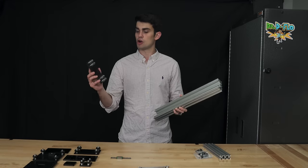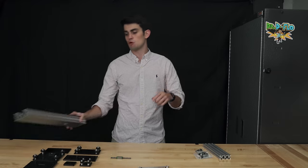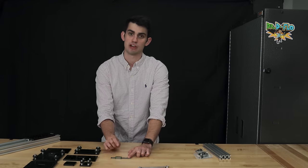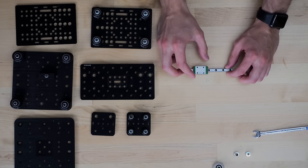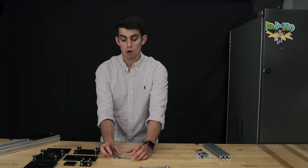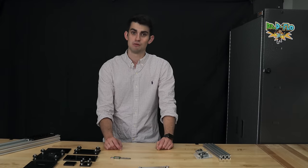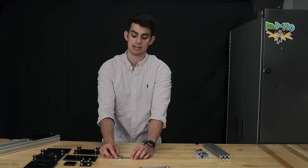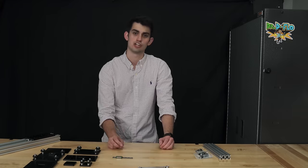We need a carriage or cart to ride on the rail to provide the actual motion. This topic wouldn't be as lengthy if we were talking about the ball bearing carriages used in the MakerGear M2. Now, you just simply slide the carriage on the rail and that's it. If there's too much play in the carriage, you're gonna have to ask for a replacement from the manufacturer. If the replacement still wiggles too much, then you're gonna have to fork up some more cash and purchase a more accurate set of carriages and rails. The point here is that this system is not adjustable.